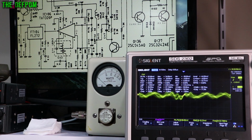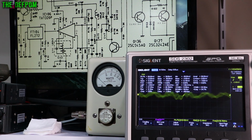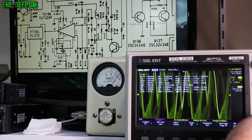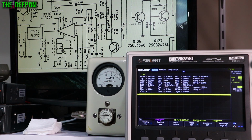And that's on sideband. That's the beep coming through. So if I modulate that, trying to measure that frequency, that 10.695, is always a pain. But that's what I'm thinking now. Okay, so we know we've got one of the frequencies there, but I'm guessing the 10.695 isn't getting steered through on AM. So that's where I'm suspecting we need to be looking next.